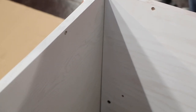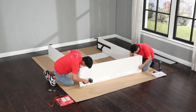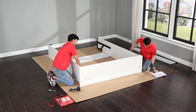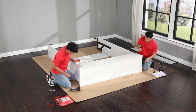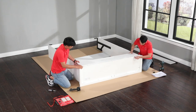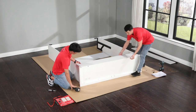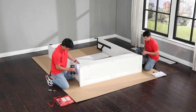Now roll up the side panels and top bridge and connect them together using the guide dowels. Insert the K110 bolts, hand-start and snug them up. Lift the top back panel and insert the K111 barrel nuts and align them. While holding the panel in place, insert the K110 bolts through the holes on the top bridge, hand-start them, then snug up all the bolts.